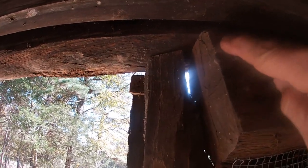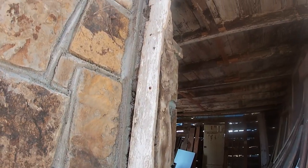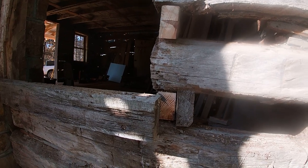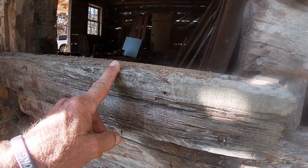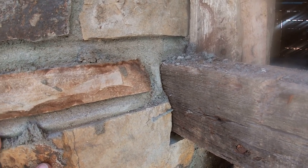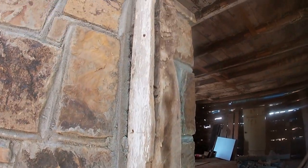I'm going to do something similar to what they did — I'm going to let my post timber go all the way up against that log there. From the outside I've just cut some big thick wedges to hold those short pieces up and keep them from falling out or settling down. You can see there's been some termites in there. This piece here goes plumb back in — I'm not sure how far back it goes. I may have to cut that off as close as I can, or maybe get it out of there.